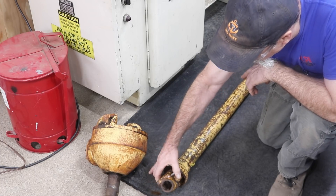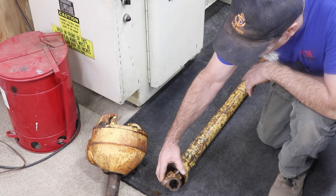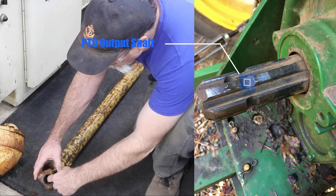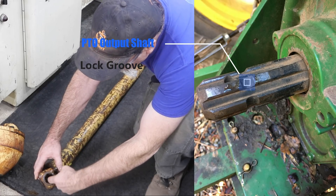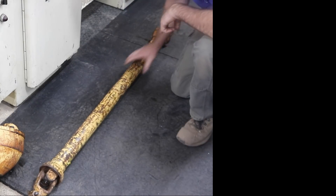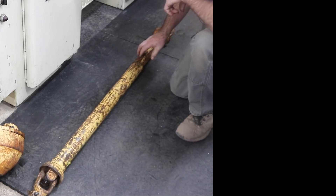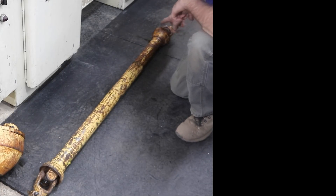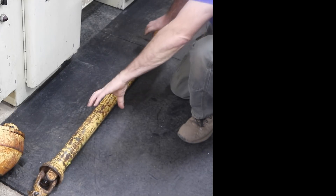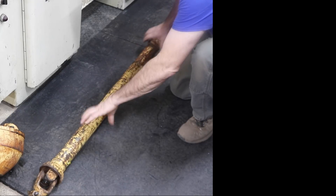There's no play in it, but this was all frozen. We were able to just get this freed up and lubricated well. This is your latching pin — it slips into a groove on the PTO shaft to keep it in place when you're using this. Now this is all frozen inside here. This will slide and extend, and we were able to knock this end apart, this U-joint apart, and remove it to get this apart. We got it all cleaned and lubricated, so this now will extend.